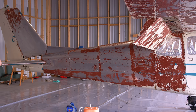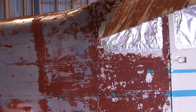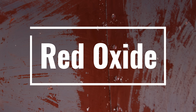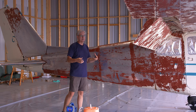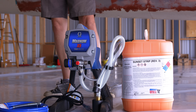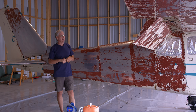I've spent two days spreading the PTI Sure Strip and it hasn't done a great job overall. In some places it worked well, but it's having a terrible time with a reddish-brown primer coat. I made a bunch of phone calls and people think it's probably an automotive primer with a filler in it — almost like Bondo — and it's proving very difficult to remove. So I stopped and called Scott at Weber Tech, who make a product called Sunset Strip. Scott said spray it on, scrub with a soft nylon brush to get into that red layer, then power wash it off.